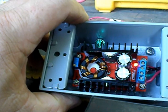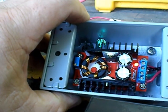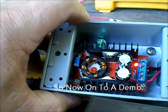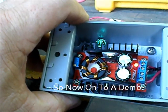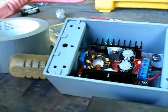Because I needed to run those big giant actuators, and I found that if I went to half voltage — which is 18 volts — they worked identical to the 24-volt actuators running at 12 volts. So it's just perfect. I bought several boost circuits but they just didn't work out, because they weren't capable of putting out enough power. These just worked out nice, so I thought I'd share that if anybody's having a similar problem.